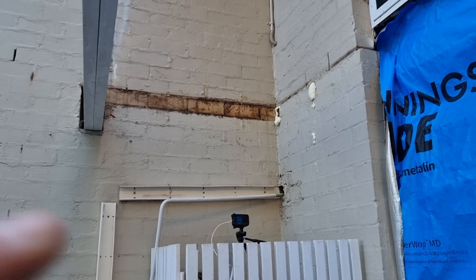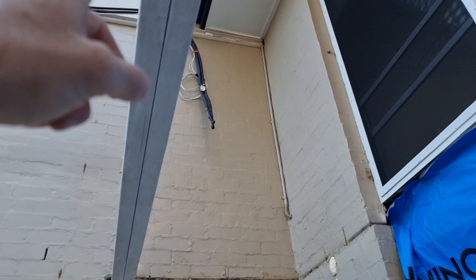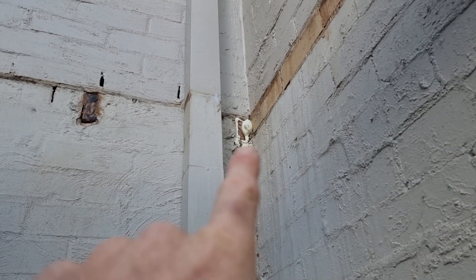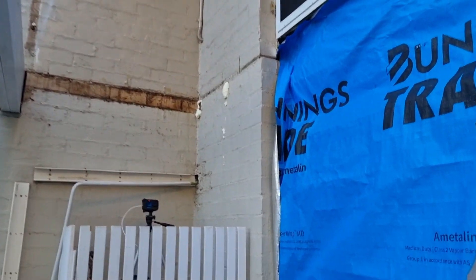This is day two of my vlogs - keep up with what I'm up to all the time. I'll see you on site. I'm just going to start off getting that joist cut and then I'll paint it, because the top of this bearer needs some paint. That joist there is ready to go up - put some paint on it so it can set and dry, then I'll cut all that up and put some sticker in those little gaps there to make sure it's all watertight.